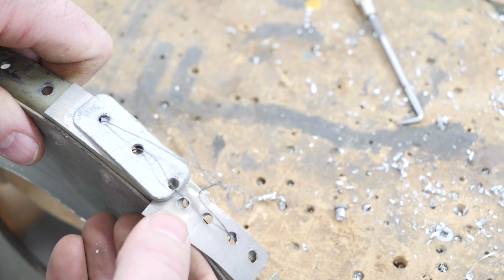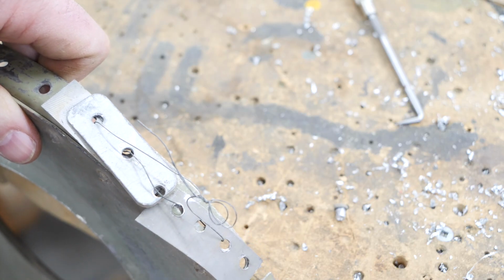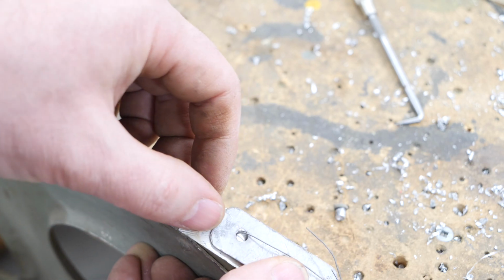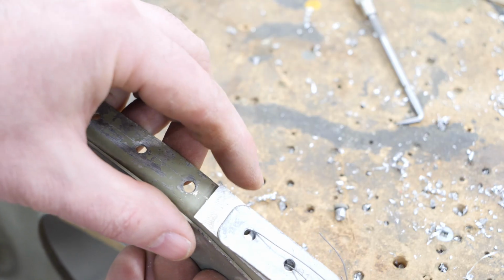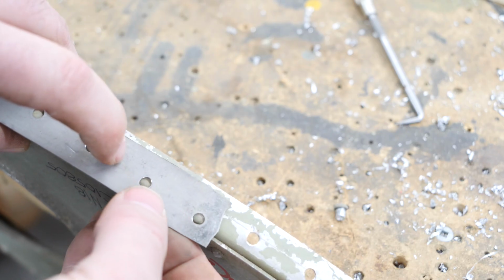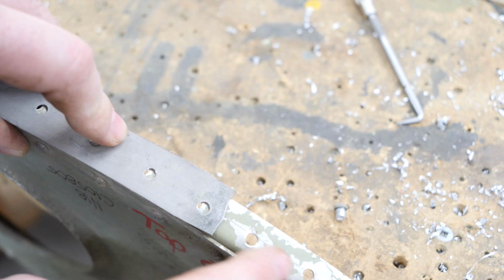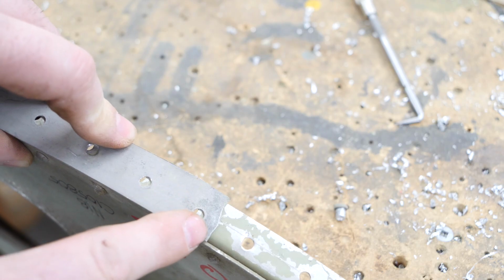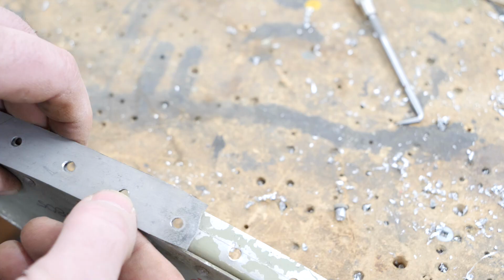None of the corners are rounded, which is standard practice, and some of them are filed. You can see the file marks here, so another hand-controlled operation that was done during the war by the factory workers. Or in some cases, instead of filing to create the taper on the shim, again to help the transition of the skin over the rib and the packer, they've taken a hammer and basically crushed it to thin the edge and taper that out. So quite interesting to see that.